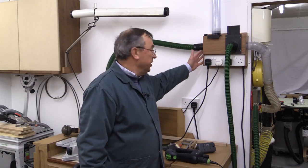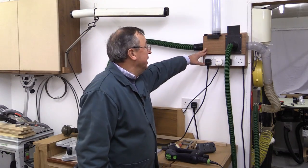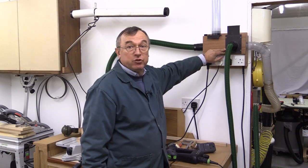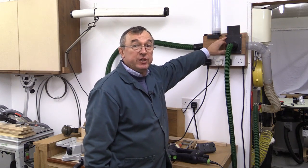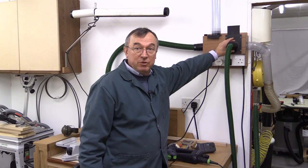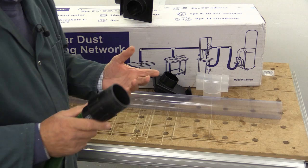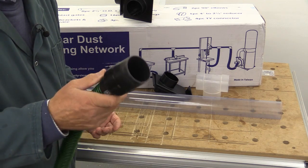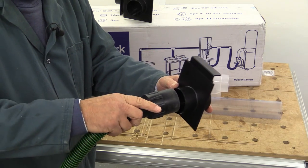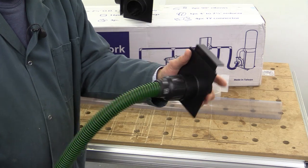When you're making up a dust hub like this, I would suggest making it reasonably solidly so that the blast gates are well supported. There are predefined screw holes in them and I've made sure I've used all four of those screws into something solid so they're well supported. Now let me show you what attracted me to this system. This is the end of my Festool 27mm hose, and here is a blast gate — and if you look carefully, that pushes in there and is held nice and firmly.